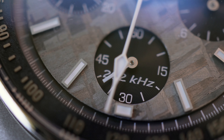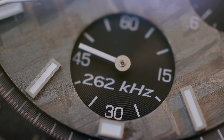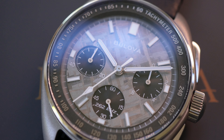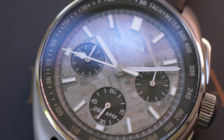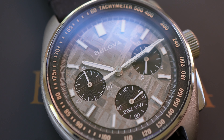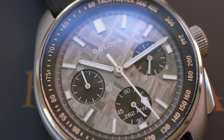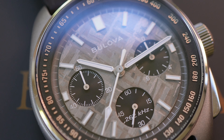On to the movement, and this is in my opinion one of the stars of the show. You can get it in the regular version of the Bulova Lunar Pilot — it is the 262kHz precisionist chronograph movement. This is high accuracy quartz, meaning it is accurate to within around about 10 seconds per year. Putting that into perspective, a regular quartz watch is around about 15 seconds of accuracy per month. This really puts the watch into the realms of Citizen's A660 or the Calibre 9F series from Grand Seiko, which sit at 5 to 10 seconds of accuracy per year.